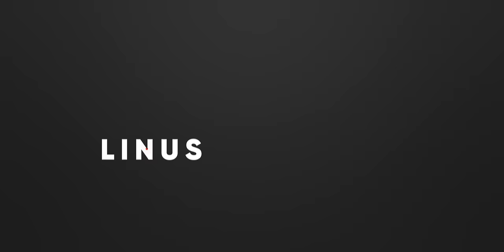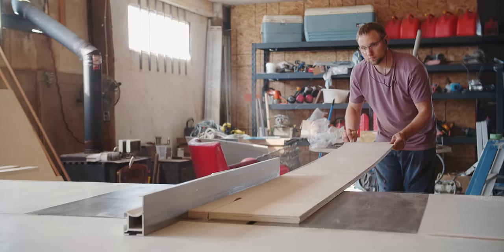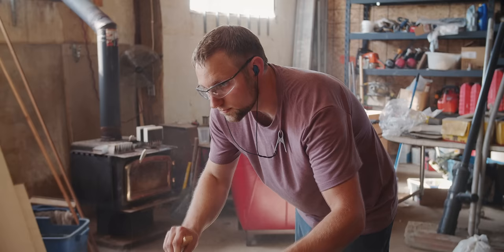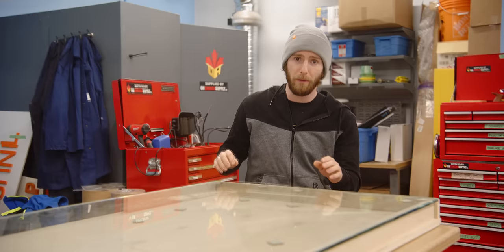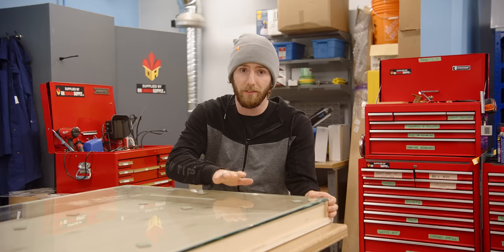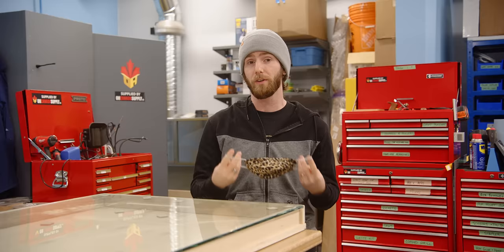Why don't we kick it off with what went well? Using the model, we marked our three-quarter inch sheet of birch wood, then used a table saw to break it into all the components we needed to build the box. The only slightly tricky part was creating a little lip on the side rails so that the glass top will have a place to sit. Once we've finalized the component placement, it's as simple as throwing the bottom piece onto the router and cutting all the holes we're going to need for final assembly.